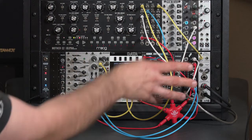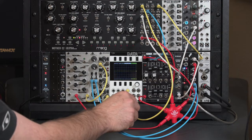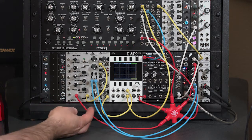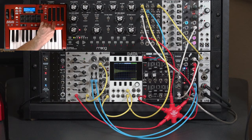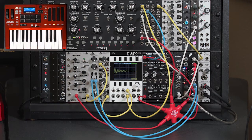I've changed the patch around a little bit — I've taken all the oscillators out of the mix. I only have the output from my percussion modules going through the Mordax Data, and into the Moog, just used as an output module in this case. I've taken a trigger from the keyboard, and I'm also using these two sliders to set the positive and negative excursion of the saturation when I have the expander switches in the external setting.